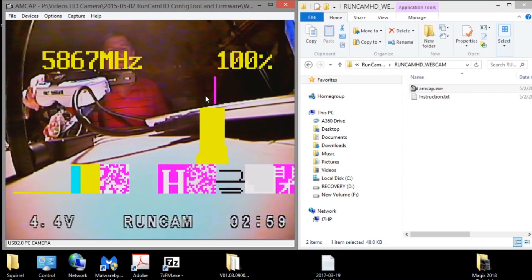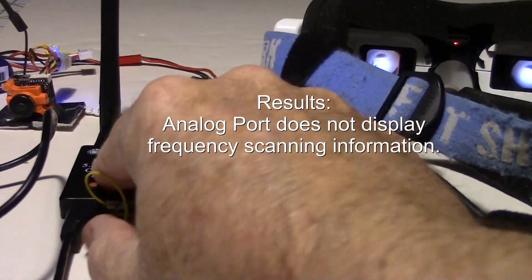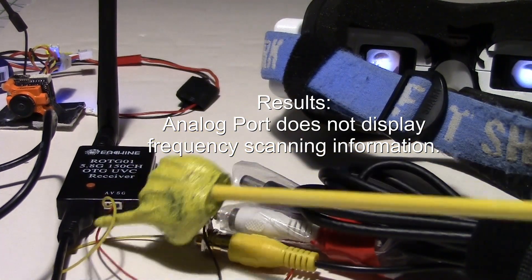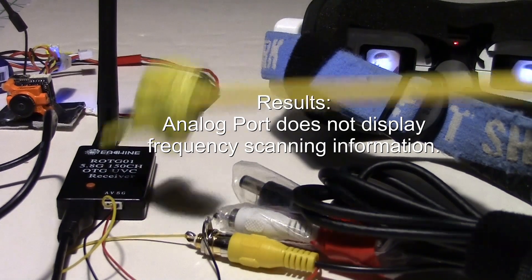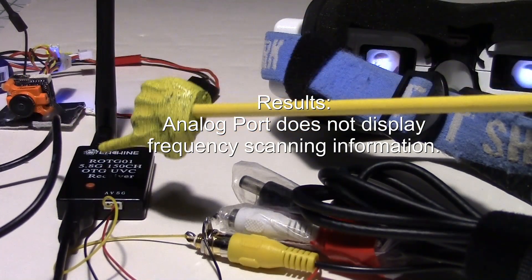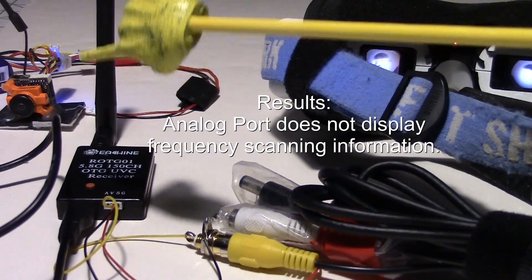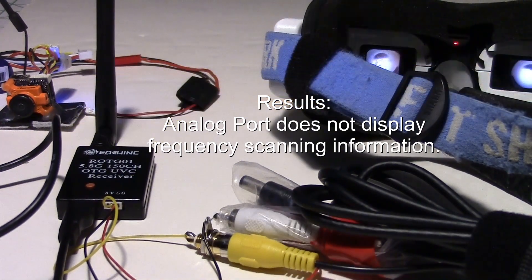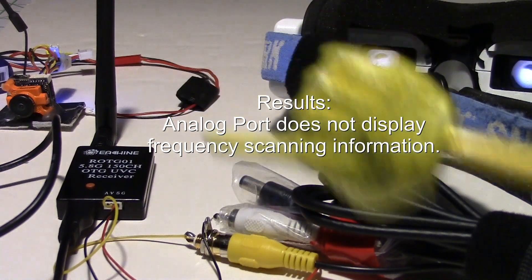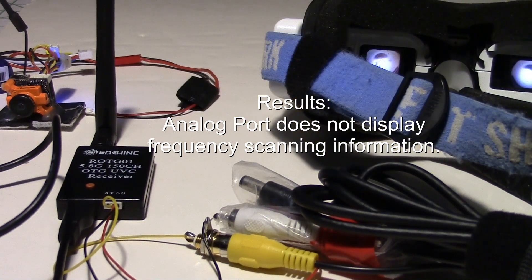So the results are still pretty much the same. The analog port — the yellow wire is video and I'm using the ground, but I'm not using the red wire; it's not even hooked up because this gets the voltage from the USB cable. As you can see, on the PC or tablet you can see the numbers and the cursor going across, but on the goggles or any monitor you might use, even though they don't blue screen and they keep the static when not getting a signal, they still won't show that digital information with the numbers and the cursor. So the results are still the same, no change. I hope that clears things up. Thanks for watching.